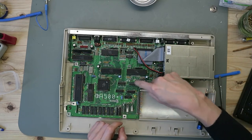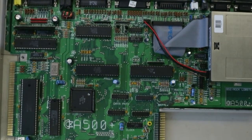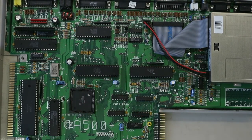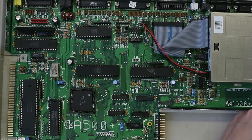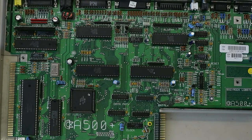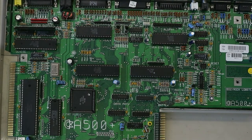And here you see a battery damage. Zoom a little bit in. There's battery damage. I opened this up before, removed the battery and cleaned this a little bit with white vinegar and a little bit of IPA. So that's the damage from the battery as it leaks. And that's the place we're looking at in this episode.